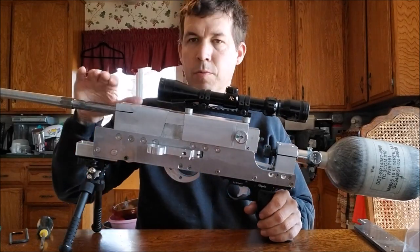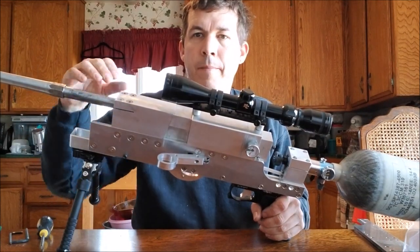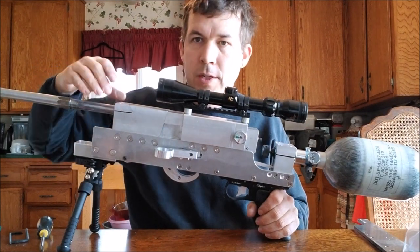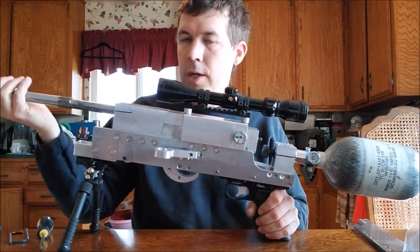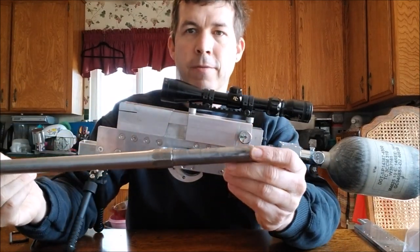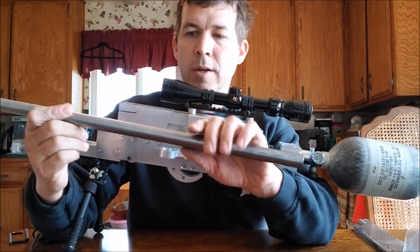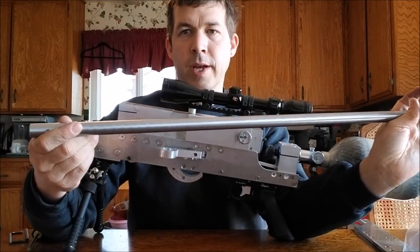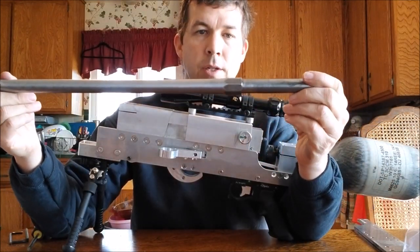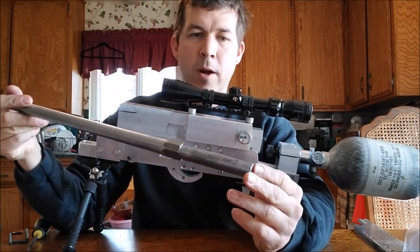I've got a full breakdown video, and on the top of the gun there are four bolts. Those four bolts simply loosen — you can see the slot here — which allows them to pull tight against the barrel. The barrel is just a regular rifle barrel that's been turned down to three-quarters of an inch. This is the barrel you saw in my first couple videos; it was a hexagon, and I've just turned it down on the lathe so it's much lighter.